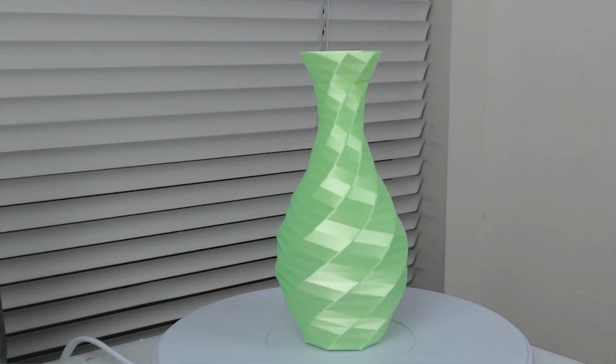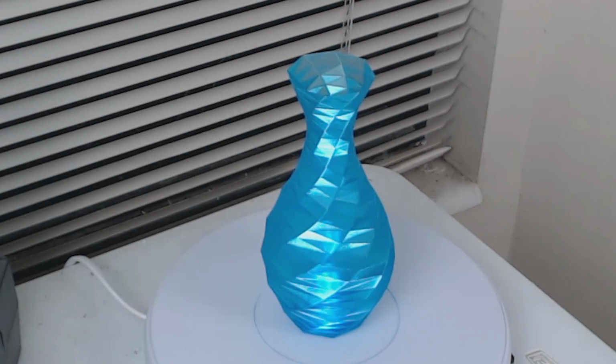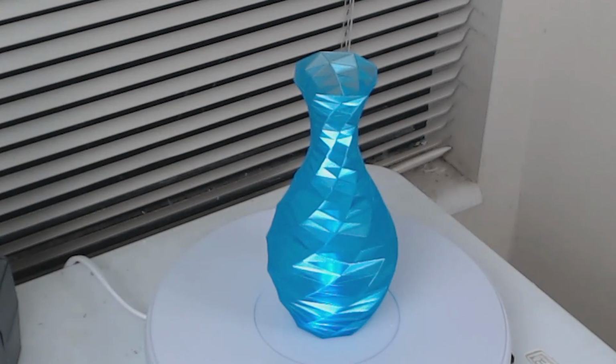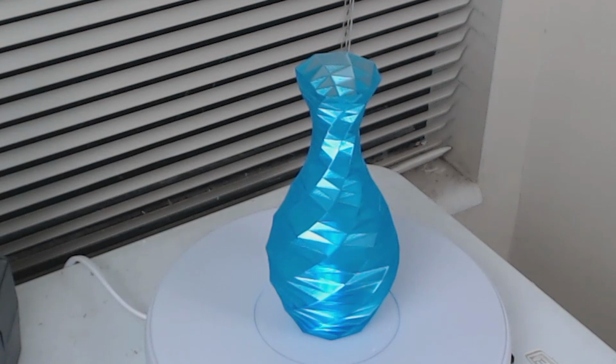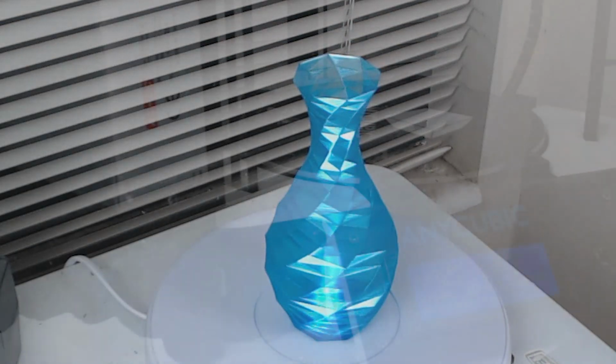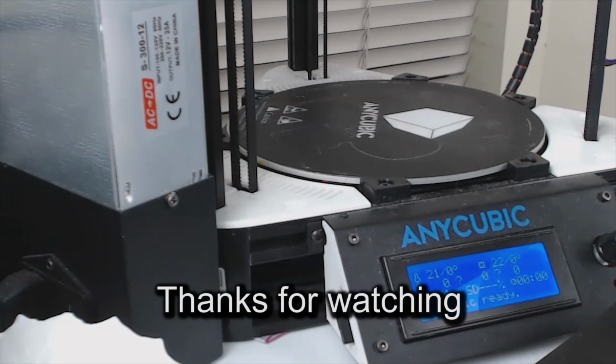The firmware needs some work and better documentation. The firmware is unable to store any modifications that you enter. So anytime you go in and mess around with it, when you power it off and cycle the power back on, you have to start all over. I understand that Marlin 1.1.9 supports this upgraded Kossel with its bed leveling probe, so I may try and install that software in the future and see if that alleviates some of the complaints I've had.